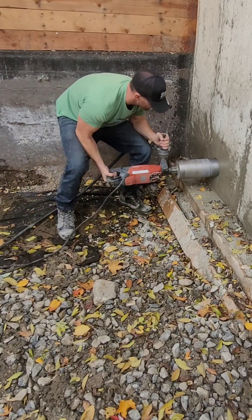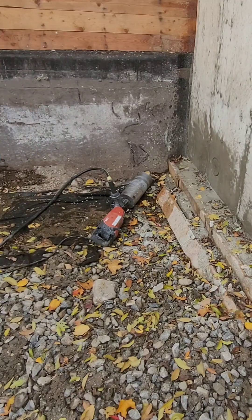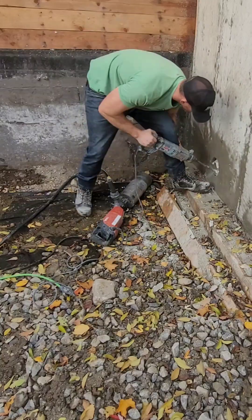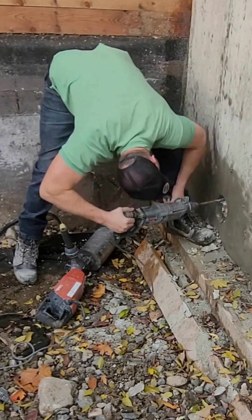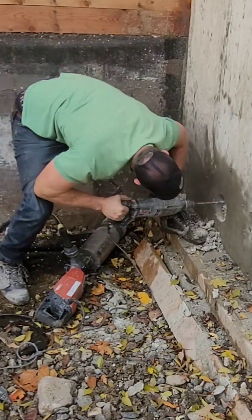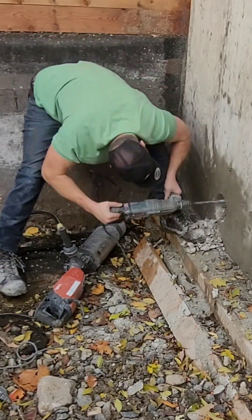So I'm about 3-4 inches in now and the problem is it just keeps slipping. What I do is take my little hammer drill and just chip that little bit out of there — that 4 inches. It comes out really easy: you already have that cut line, and once it's done you can start up again and it doesn't have anything to bind on anymore, which worked out pretty good.